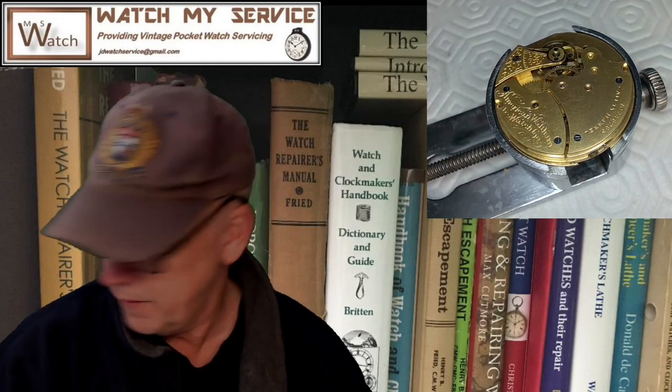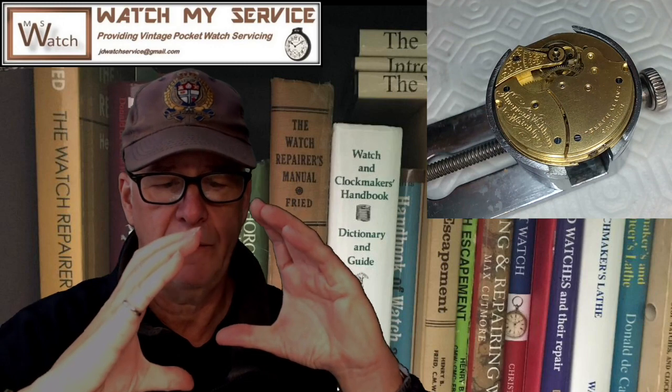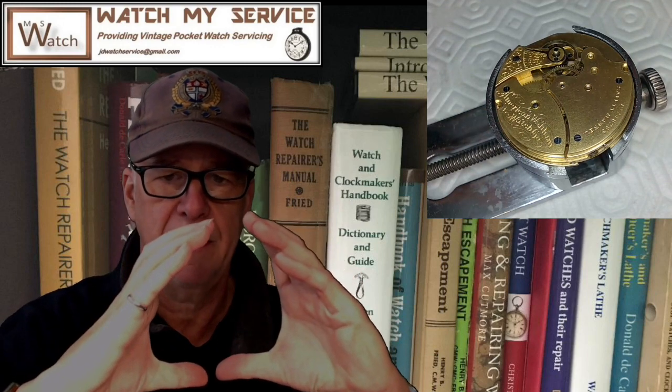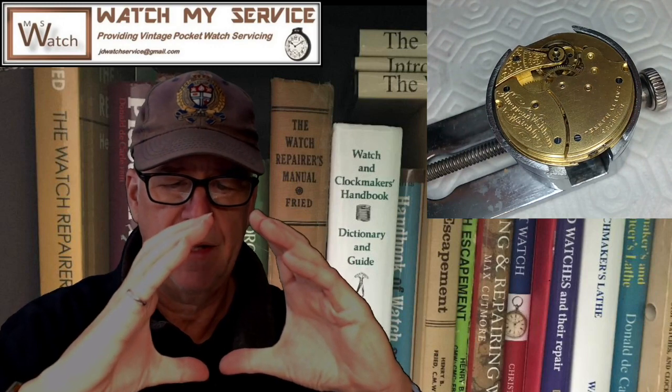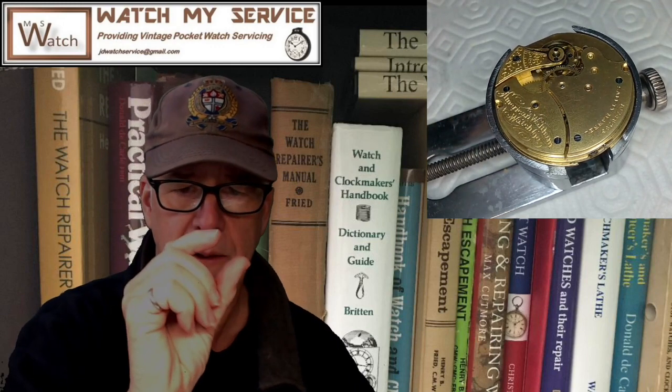A set mainspring is where the coils are really wrapped in tight and there's nothing left. But this is a fairly small barrel, so if the coils pull out to about seven or eight inches and you're rolling that all into a barrel this size, you're still going to have a lot of power left. It's not going to be an incredibly set mainspring. With a size 18 watch and an 18mm barrel diameter, you can't generate as much power, but those springs are a lot thicker and stronger anyway.